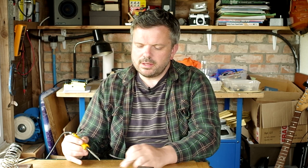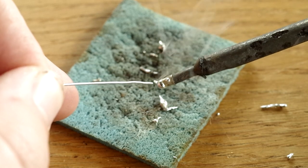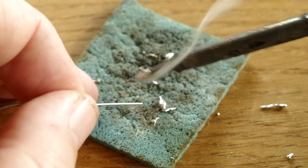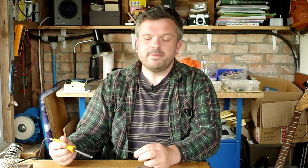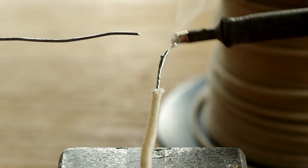Clean the tip, keep going, add some, clean it — just see how it behaves and get the real feel for how the solder behaves on the end of your tip. Because once you've learned to control this, you can then control putting it on other objects, and that is lesson one — just to build that confidence with the solder. I hope you found that useful. We're going to go on to lesson two now, which is tinning, and that is very important. We're going to learn how to tin, tin some items, and then finally solder an item onto another item and do it confidently. I'll see you there.